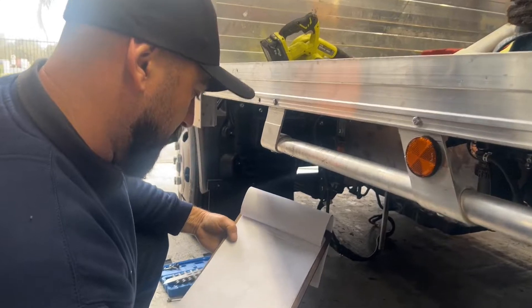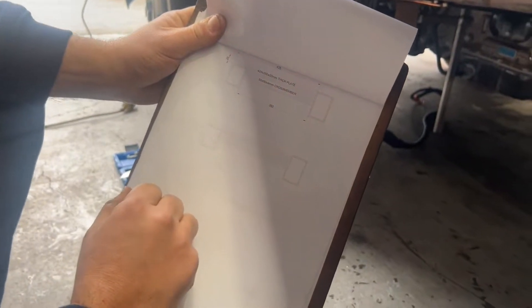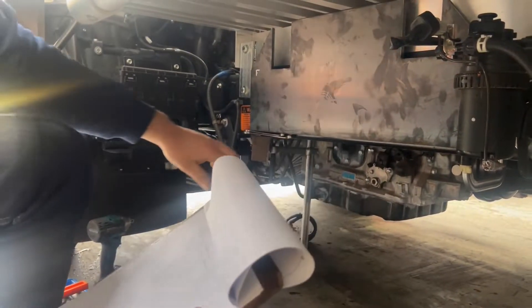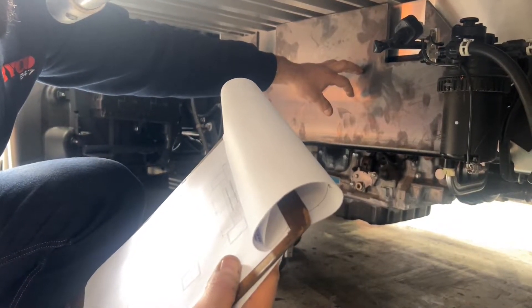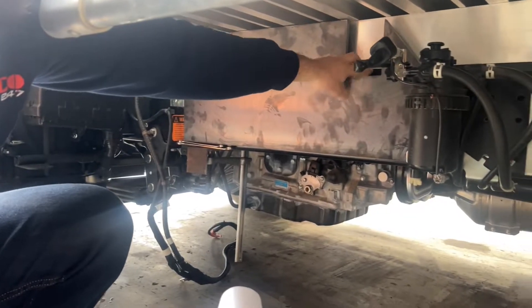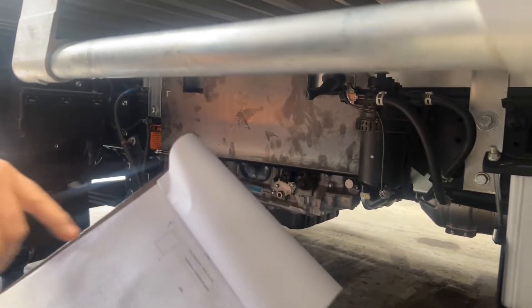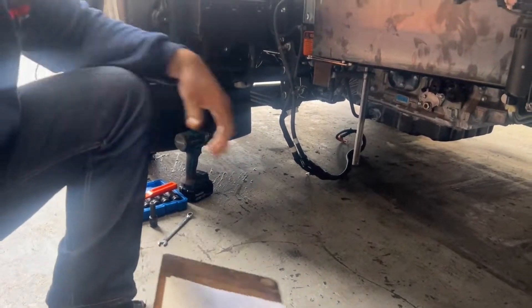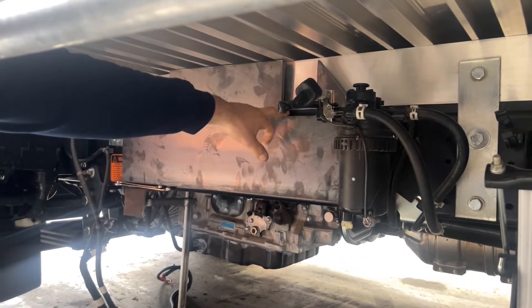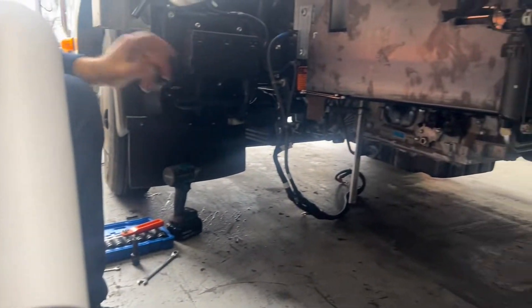If you look at that, there's a cut-out there for the chassis supports. You can see that's the cross member we'll put on. As you can see up here on the chassis, we'll have a 50x50 by 4 RHS which will sit on top here where Mick's got it. We have another RHS in there as well — one gets bolted to the side. That's the actual leg beam — the leg beam is the back one. The stabiliser leg slides in that one. And this is just a strengthening beam — it'll go around to the other side as well.